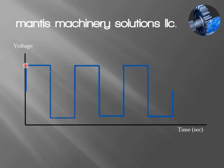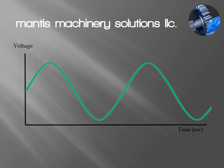So we talked about these voltage pulses — it basically looks like a square wave. If I were to connect my oscilloscope up to the read head, this is probably what I would see. Anytime I have a high voltage, I'm getting light to the sensor; when I'm not, I don't get voltage. I can count these peaks and determine how far I've gone. Another way of doing this involves a sine wave as compared to a square wave. If I'm directly on top of a tick mark, I'm producing a certain amount of voltage. As I get a little bit further away, a little less light reaches the sensor, but it's still producing some voltage. As I get further away or directly between two spikes, I produce the least amount of voltage — so overall it looks more like a sine wave. It doesn't matter to the control because we're really just counting the spikes — as long as I'm above some threshold voltage, like 0.8 or 1 volt depending on the setup, I still know how many tick marks I passed.